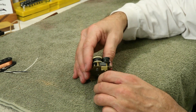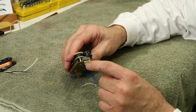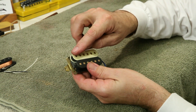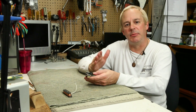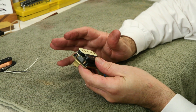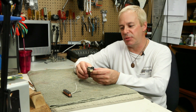In the case of what's known as a humbucking pickup, two coils are joined together over a common magnetic structure, allowing one to have north and the other south magnetism at the top. The coils themselves are wound in opposite directions, thereby creating a mirror image of each other. This allows them to cancel out each other's 60-cycle hum, creating what is known as a hum-canceling or humbucking pickup.